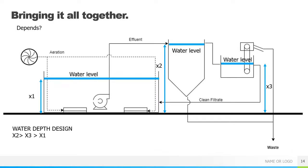So that pump is only responsible for picking up the effluent in the middle of the pond up to the clarifier where it's settled for some time, and the clean water is actually overflow by gravity into the retention tank whereby it is actually being worked in the protein skimmer. And after it's being worked into the protein skimmer, it actually overflows back into the shrimp culture tank, right? So only using a single pump to control everything, so it's straightforward, no trying to balancing all the flow kind of problem, no overflowing here and there, so pretty straightforward.